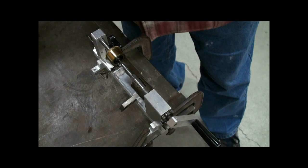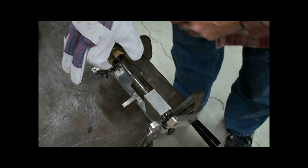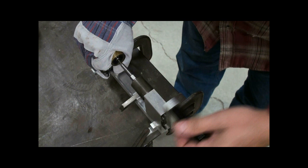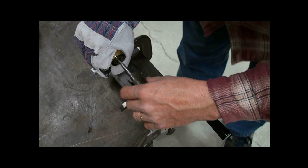Put it in the back and lock it down tight. Then with a gloved hand, you hold onto the barrel and wind the spring fully. There's a ratchet here — set up the ratchet; it allows you to wind. Wind it up enough so the sleeve can fit in.